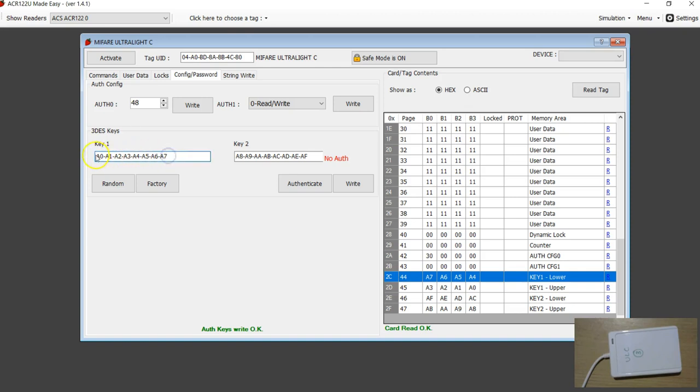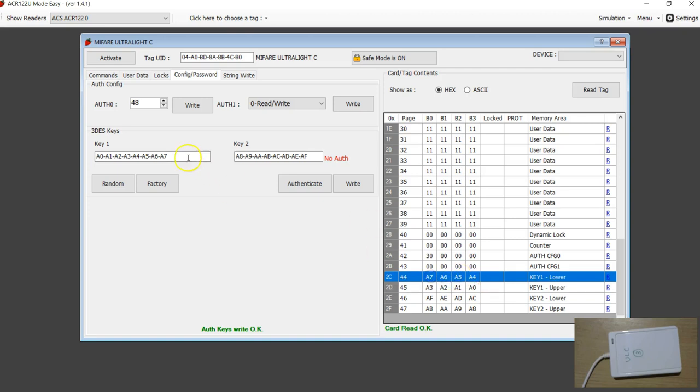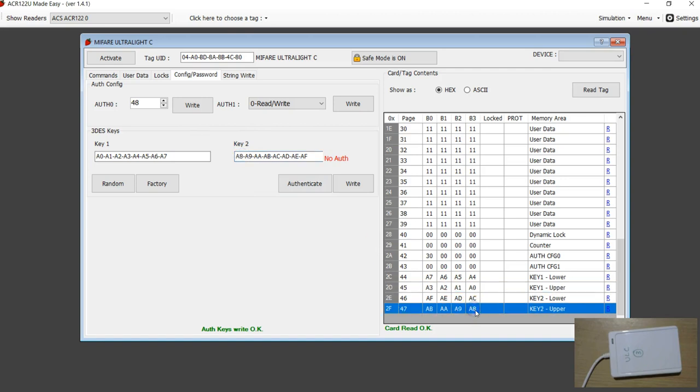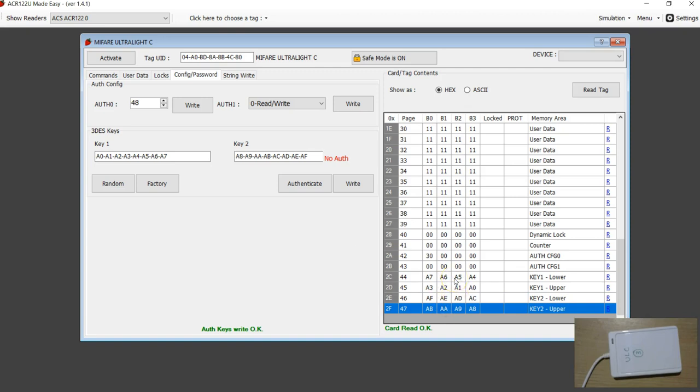If you look at the password here, it's A0 to A7 and A8 to AF, whereas the way they're stored in the tag is something different. If you treat this as the lower byte and this as the higher byte, then you just have to trace it from here. So A0, A1, A2, A3, A4, A5, A6, A7. The lower byte is stored first, and the higher byte is stored at the end. Similarly, this section as well. So A8 starts from A8, A9, AA. This is very well explained in the data sheet. We are going to revisit this in the next video.